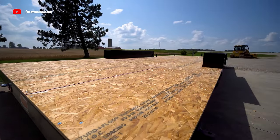The next piece is made almost the exact same way. I just made the angled cut right on the measurement this time, not an inch further. And then those two pieces should meet right in the middle of this peak. With that first piece being cut an inch longer, I still have that inch overlap here too. And then these last two pieces are made the exact same way. I just had to score that bottom edge off a little bit further where these pieces overlap the lower fascia.